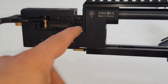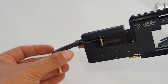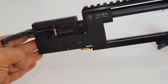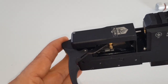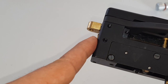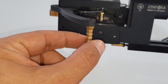To see the mechanism, first release the safety, hold this arm very well, and gently squeeze the trigger. When you hear the click you know the hammer is released. This spring inside is responsible for pushing the hammer forward. If this part is too loose and goes too far backward, the gun may be too light to hold the cocking position.